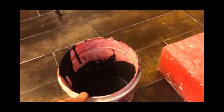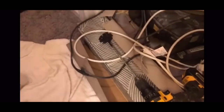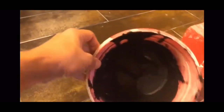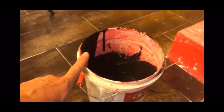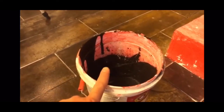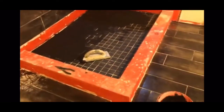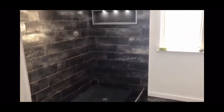Over here I'm cleaning up my shower tiles. Try to use a 2x2 inch tile when you do put it in your pan — it's a lot easier and better to work with as far as the slope goes. If you use a bigger tile like a 4x4 or 8x8, you can't capture that slope. I'm using a black grout here — the customer wanted black grout for less visible mold or color change over time. Here's my floor that I put in; it took a couple days. You've got the niche built into the shower — everything is pretty much ready to seal. Beautiful looking shower — glass door installed!